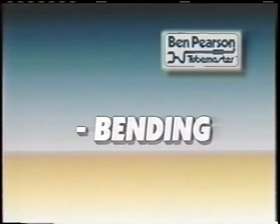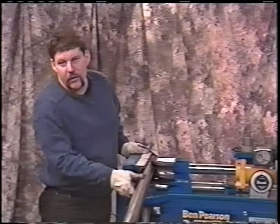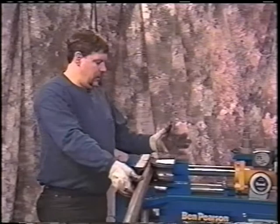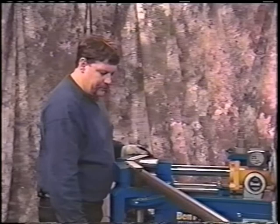Now we're ready to bend that pipe we talked about underneath the car. It's 2-inch diameter tubing that's been predetermined. We've looked over the pipe to know how that is supposed to fit on the vehicle. I already know that I need approximately 7 inches to my first bend. I know that my die is 7 inches in length. So the first bend I'm going to put in is to follow this around to 50 degrees, and that'll be my first bend.